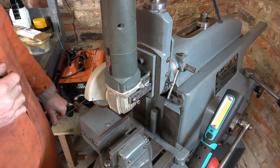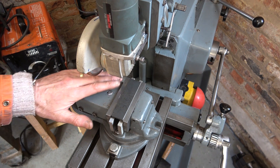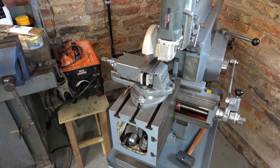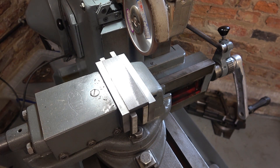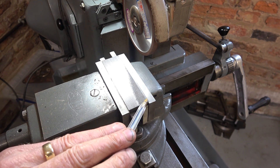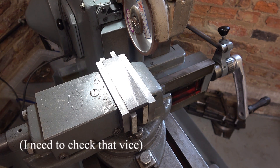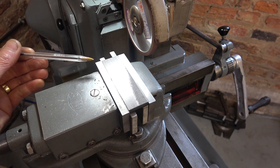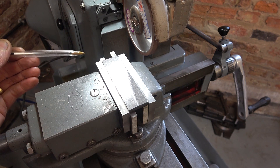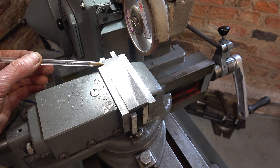I'm going to try grinding a piece of soft steel and see what that goes like — I wanted a really nice finish on this piece of black plate. I'll stop at that point. I've made several passes increasing the cut by a couple of thou each time, and you can see what's happening — this corner is lower. I think the problem is the vise itself; it's not a particularly precision vise. The table is better than the vise. You can also see where I was trying to touch off and managed to get that wrong. It's quite difficult to find the touch-off point. Anyway, you can see the surface — it's a little bit rippled, just a tiny bit. But I'm quite pleased with that for a 30 quid project.